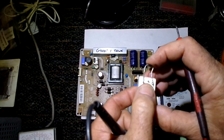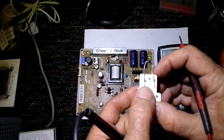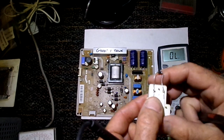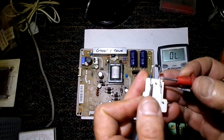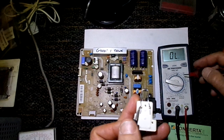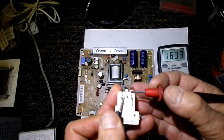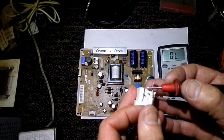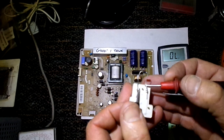In the past, I would often find myself unsoldering a lot of diodes and checking them again to see if there was something else going on. But I find it can be a real time saver to just flip it over to the resistance scale and see if you've got an actual short. Because almost any time a diode goes bad, it's going to have 1 ohm or less resistance across it. Here on the resistance scale, I'm able to measure 161 ohms — that's showing me the resistance of the coil, not really picking up anything from the diode. That's one helpful tip.